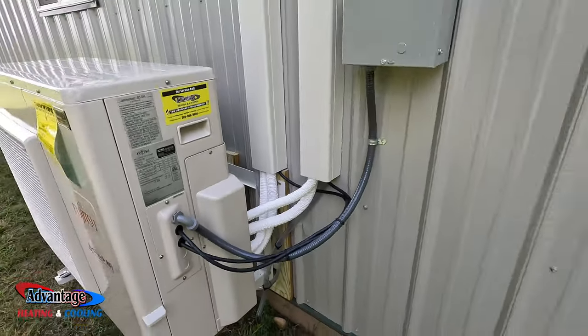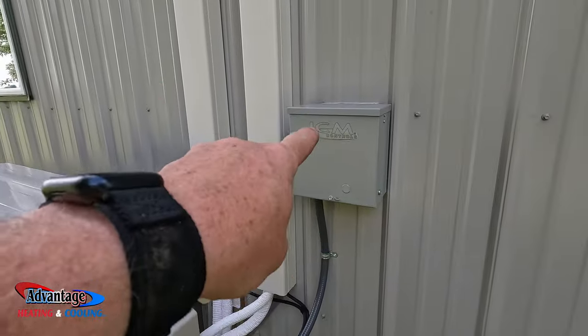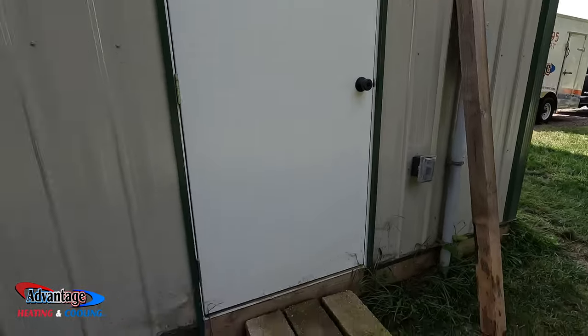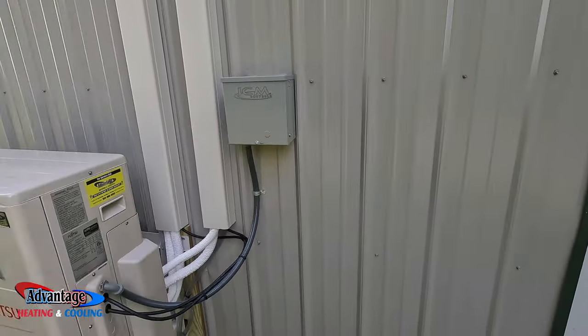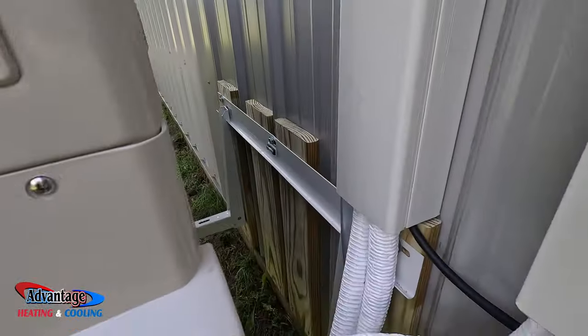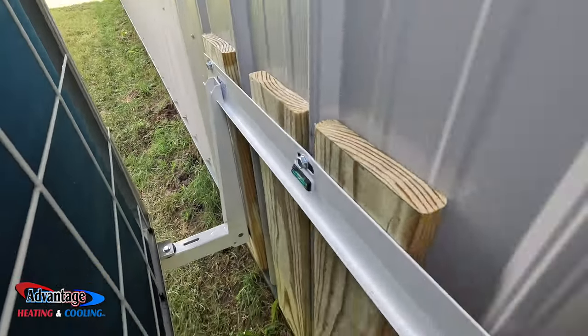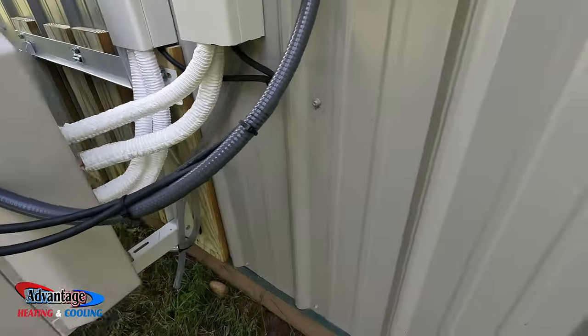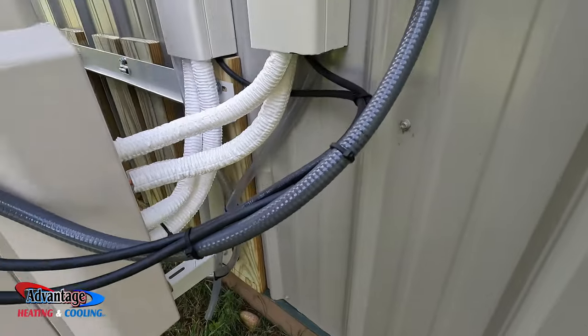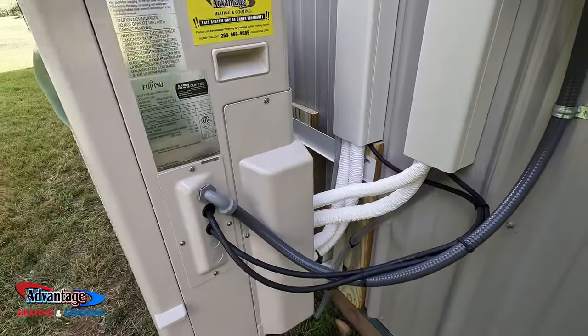So yeah, we're all set. Corey wired the ICM control up and we're just waiting on the electrician to run his feed from the panel inside, probably down and up, and hit that — and this is all ready to go. We had to put these boards down here in the back because there's two by four purlins going across and it just wouldn't have been stout. It is what it is.